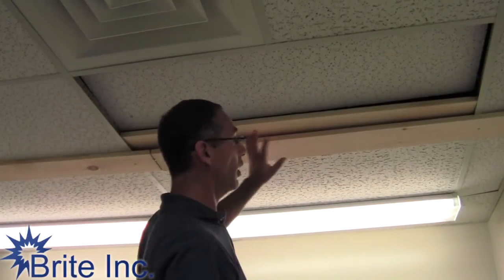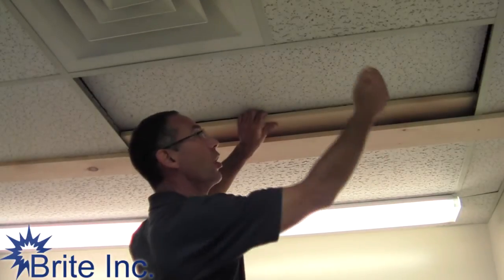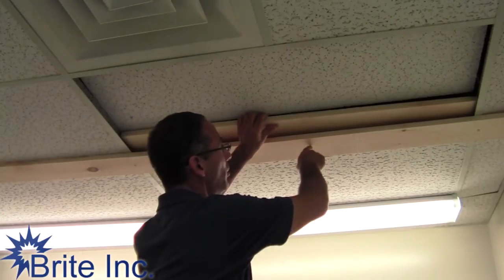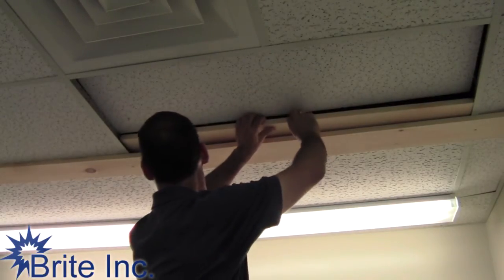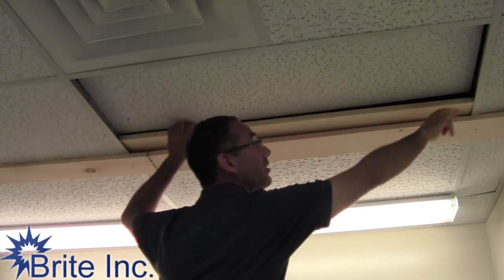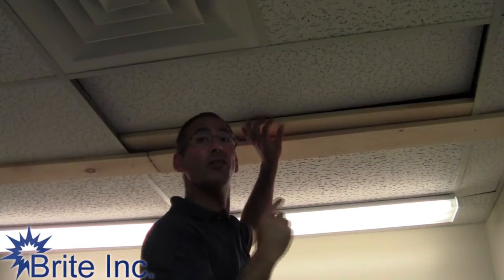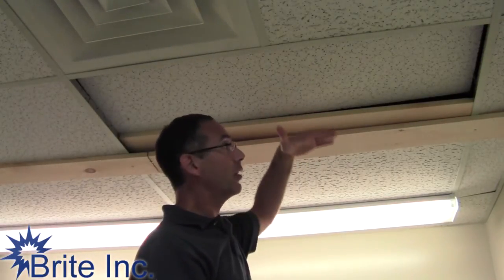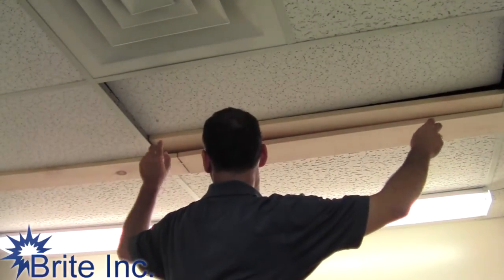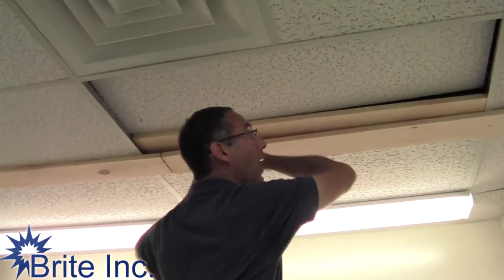I've put the rest of the wood up. This piece of wood here is going to go above the ceiling tile. When I screw it, the screw goes up through the wood, through the ceiling tile, and sandwiches in between. I cut the wood so it sits on the ledges of the grid, which distributes the weight across the ceiling tile up to the deck above — that's where the weight gets distributed. If you used small blocks sitting on top of the tile, the tile would sag over time. No matter the size, go from edge lip to edge lip to distribute the weight evenly, and put screws across — it'll be a nice secure installation.